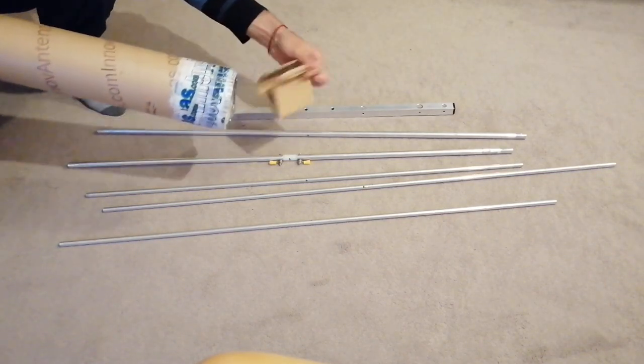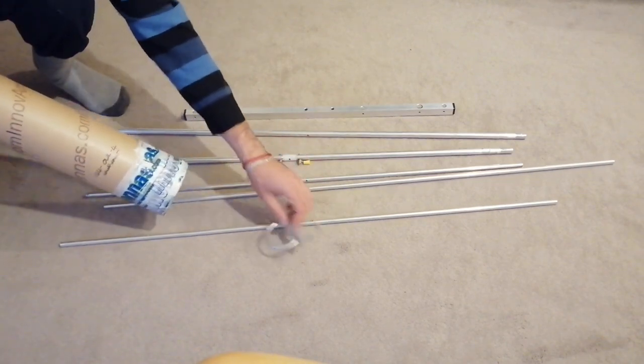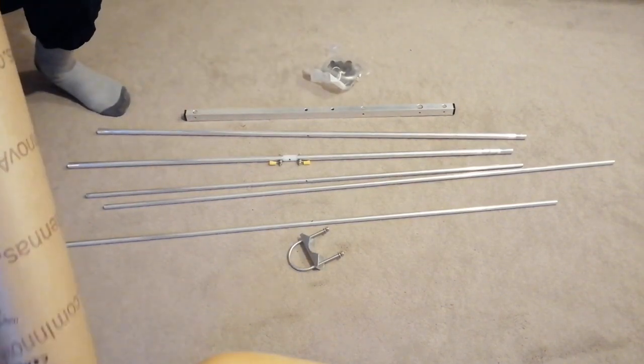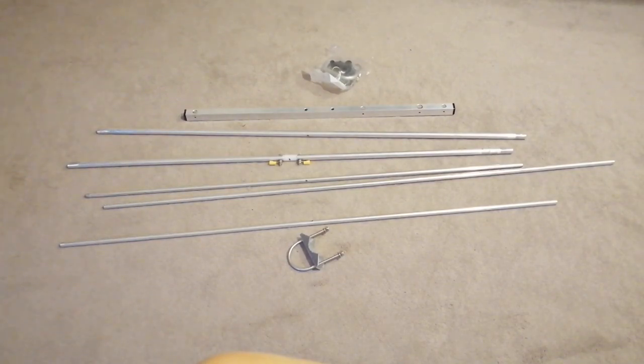Let's have a look at the overall performance. I took these details from the manufacturer's website, which you can find in the description of the video. Gain is 8.23 dBi at 145 MHz. Gain 10 m above the ground is 14.1 dBi.